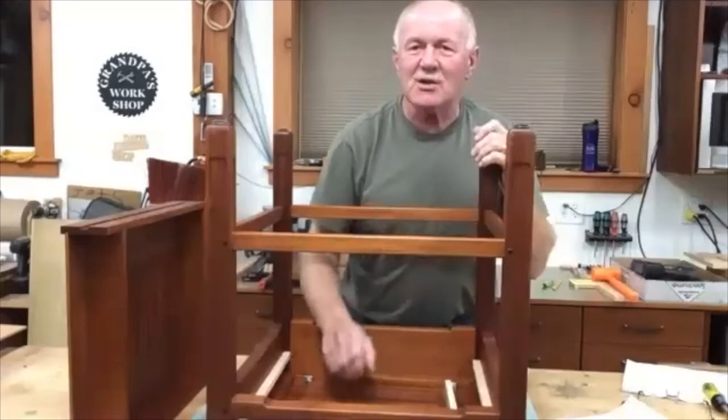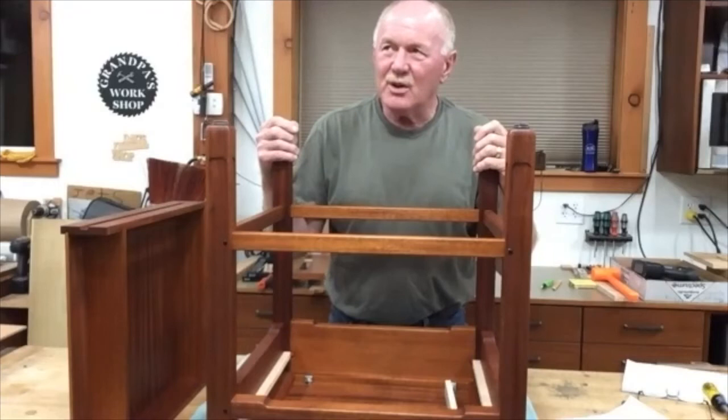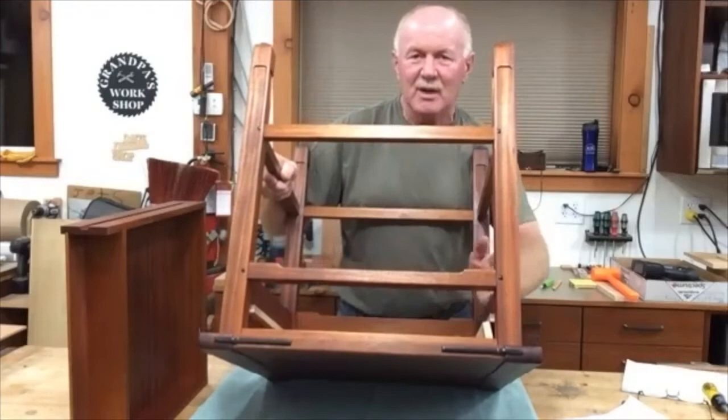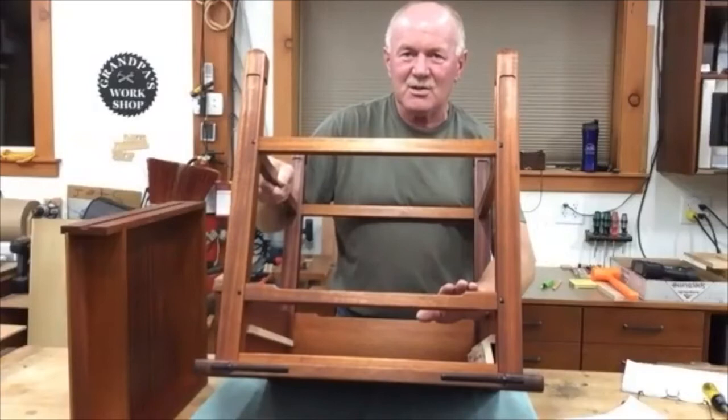This has to do to some extent with the design of this particular piece and the fact that it has this trim strip on top. You say that's there to attach the top. Well, yeah, it is. And there are a lot of other ways you could attach the top that would not involve that extra trim piece. But at the same time, it gives us that consistent reference point all the way around, and specifically on the left and the right side where the drawer runners need to go. It gives us the perfect reference point to be able to suspend the drawer from a fixed location and have it come out spot on in the center of the opening.